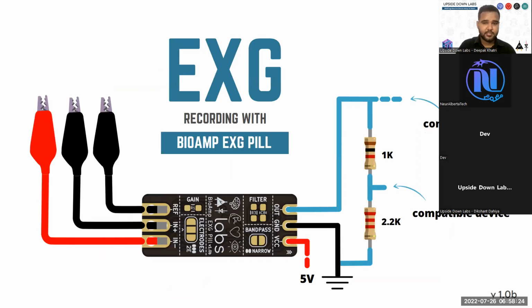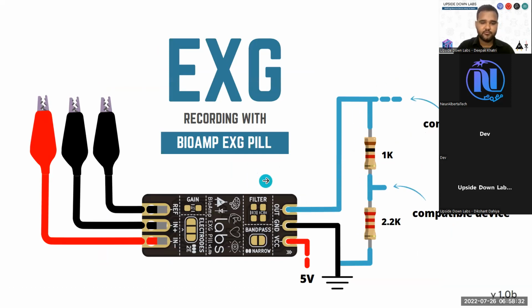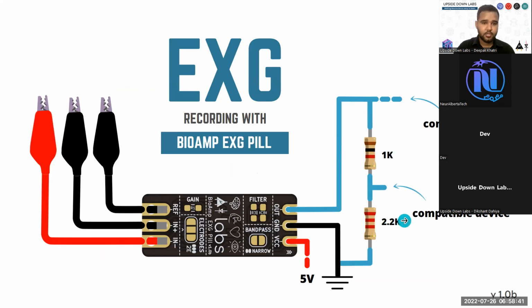If the previous connection diagram was not clear enough, let's see it here. When you output the signal, that output would be 5 volts because we are delivering the VCC at 5 volts. If you divide the 5 volts in a portion of 1 and 2.2, you will find that it is now compatible with 3.3 volt devices also. You can find the entire calculation, and how we use the ratio divider method to convert the sensor output from 5 volts to 3.3 volts, on online platforms also, like Google.